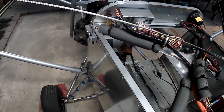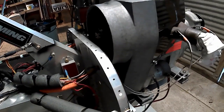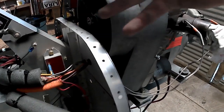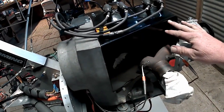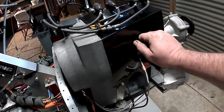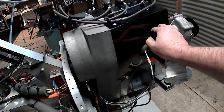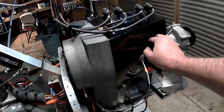As I mentioned, this is my fan unit here. It draws air into this plenum — this air box — and blows air over my cylinders. We did find out the timing was off on this engine, which could have been causing a heating issue. We also found many seals that were just really dried out and leaking, so we replaced those as well.